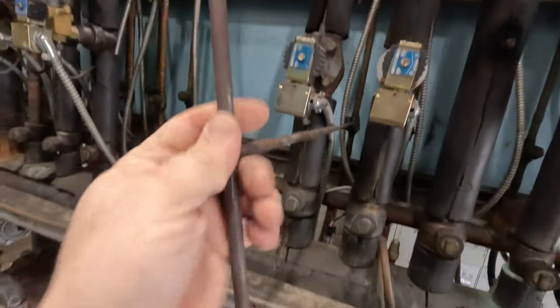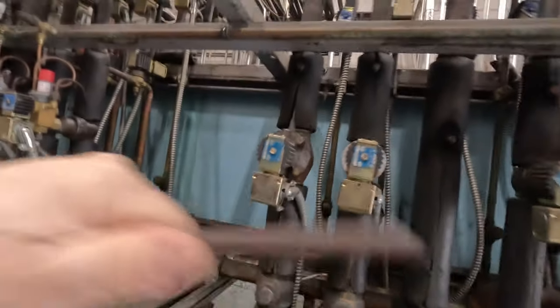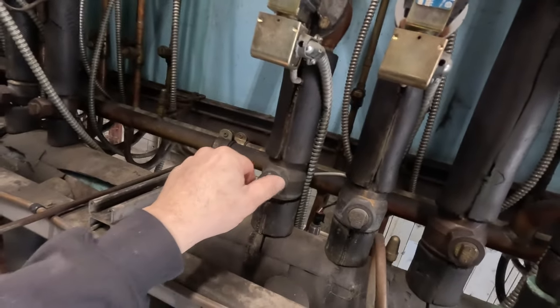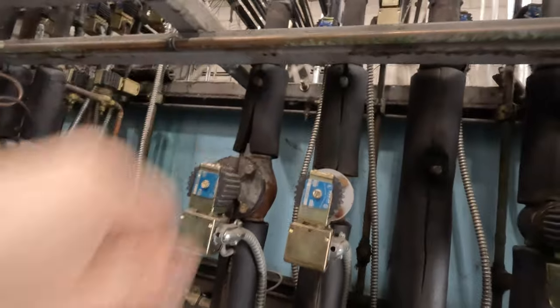Let's see if we can shut that one produce case off. Coming across here — it's 14. We've got our long wrench here. There we go — liquid's off. That's going to allow it to suck down. We'll tell the rack to start sucking it, and we should be able to pull her down. Then, once we get it down low enough, we should be able to valve it off. We need a gauge to kind of make sure we're there. May force some compressors on to get it there.